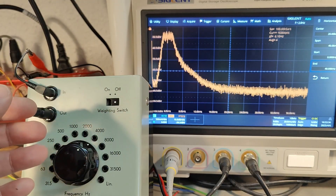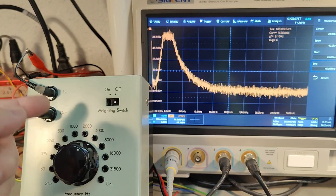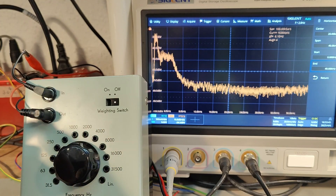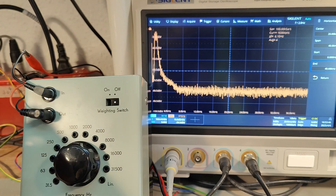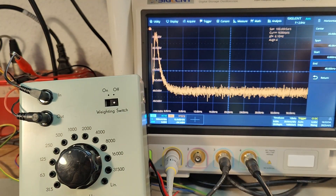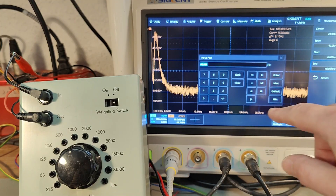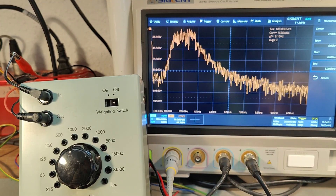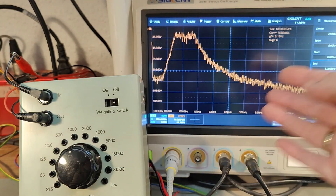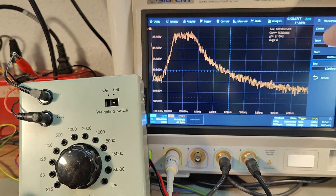You can also detect harmonics with this one, of course, when you know what you have — if you have a 1 kHz signal. So let's go from 1 kHz here. Now we are here, and then we should probably change the start and stop frequencies. If I change the stop to 5 kHz, for example, then it's easier for us to see what's going on because we have a linear sweep on this oscilloscope spectrum analyzer — it's annoying, you can't change that, by the way.